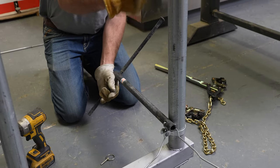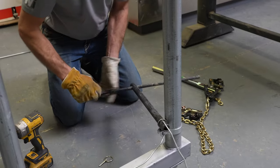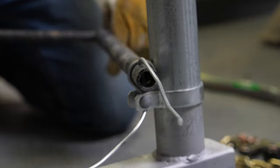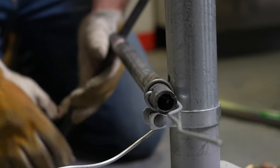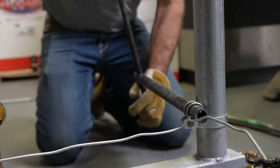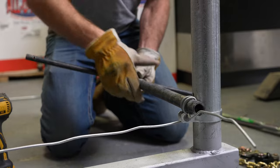I bent it over and now I'm going to start rolling it back towards the post. As you can see, that wire is pulling through. It's wrapping around the pipe and then my handle slides this way so it's not ever coming in contact with the ground and I can work it back and forth. I can feel it getting tight — and that's exactly right, that's when you're right where you should stop.